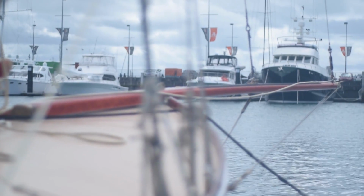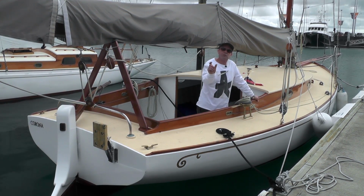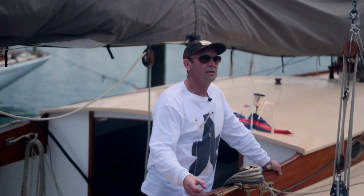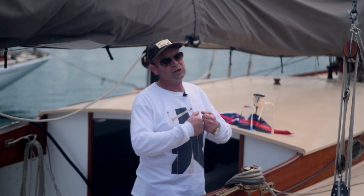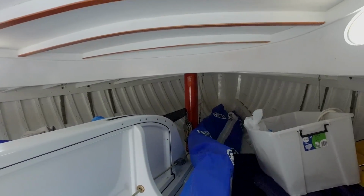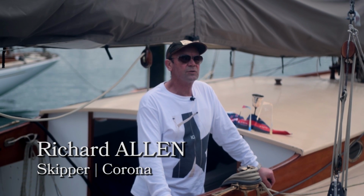They're built out of kauri. They're built with a carvel planking system, which is 3/4 inch kauri planks on the outside, and spotted gum or pahutakawa ribs on the inside, clenched through with copper nails and roves. Internal ballast of about 2.5 tonne in lead ingots, plus a 12 mil cast iron centreboard and centre case.